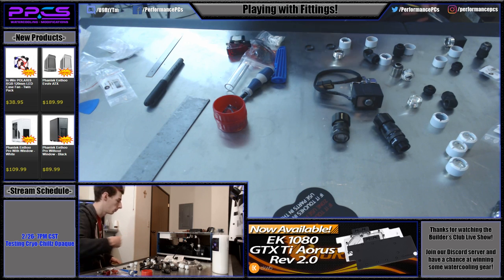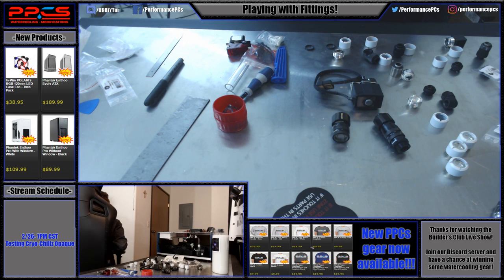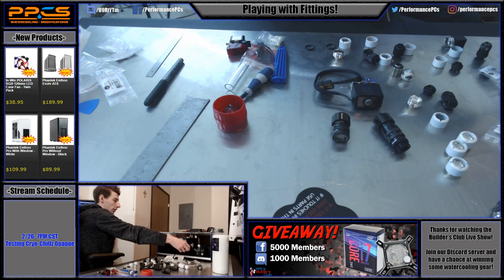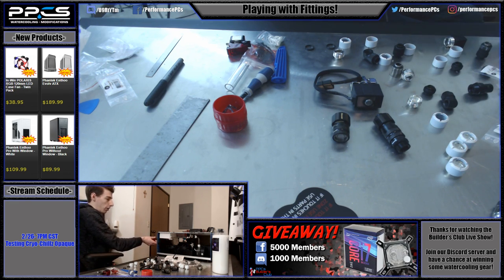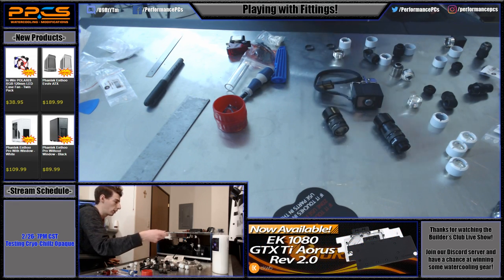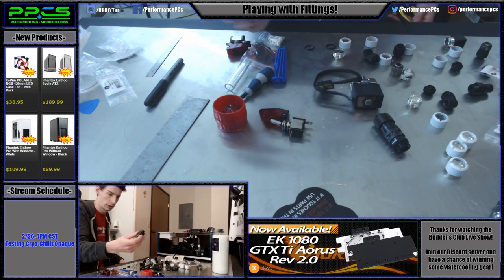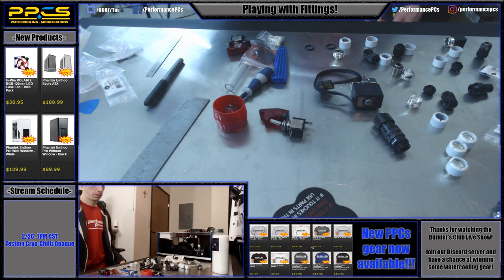And so why don't you just get a butterfly valve? A butterfly valve? Or, sorry, just a regular ball valve? Yeah, I was thinking about that. However, then I have to reach in and turn the valves. If I can get these to work, I can just wire them so there's a switch at the front of the case right next to the bulkheads, the quick disconnect bulkheads. Then I literally just flip two switches and plug the disconnects in, and you have another radiator in the loop in like 5 seconds.